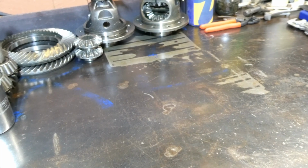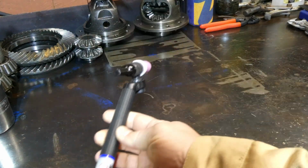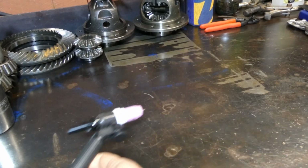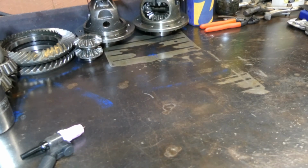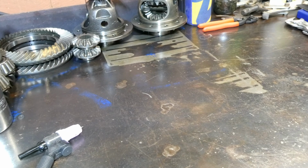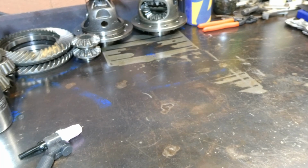Okay, so we're back and we're going to talk about the Tetrix foot pedal. This is a great addition to the whole package, in my opinion. It's a great way to allow you to use single piece, single hose torches with no buttons. So you have a very compact and flexible torch package without the need of extra buttons and everything else getting in the way. You've got the bonus benefit of adjustable amperage on the fly, which is great. So let's get the pedal up onto the table and have a look and see what it looks like.